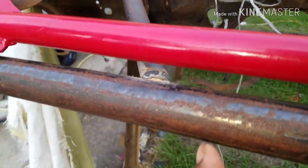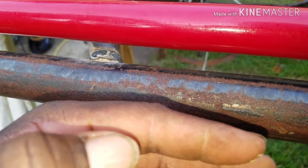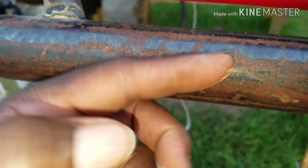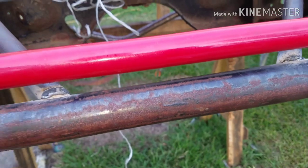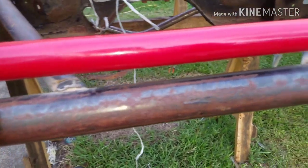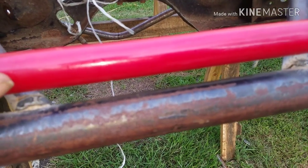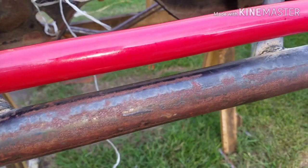From here straight out, it came out to like 25 inches till it hit his gas tank. So this pipe, I think we're gonna clear barely. It's a little fatter than what I used on the cutty. This is like 1 inch and 3/4. This is like 1 inch and 5/8. You could just say 2-inch piping. It's like 3/16 thick wall.